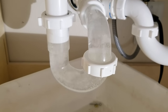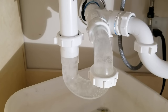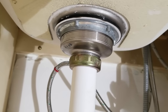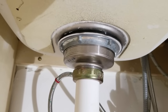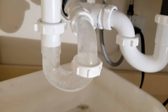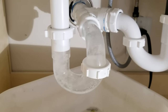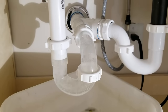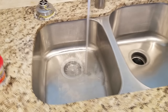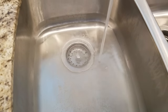I've let the water run for a few minutes and now it's all hot water coming through. Looking up top here, there's no moisture around the drain, which is a good sign — that means we sealed it up nice and solved the leak up here at the kitchen drain. But our testing is not done yet. Now that we know it's okay with the water running, I want to fill up the sink with water and let the whole thing go. That's another good test — fill up the kitchen sink basin with hot water, then release it and let it flush down the drain and into the P-trap and see if that rush of water makes it through okay.